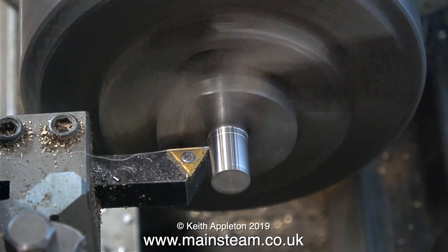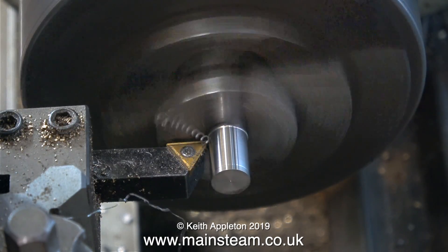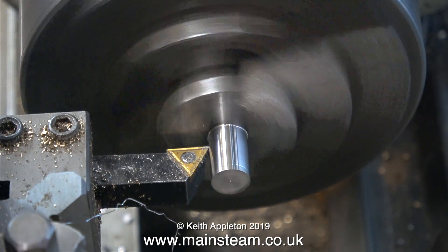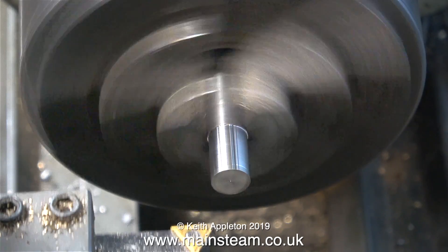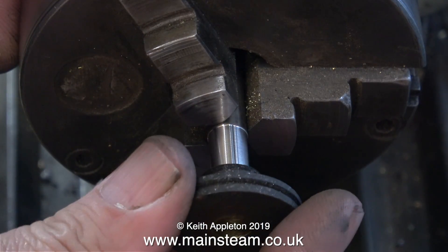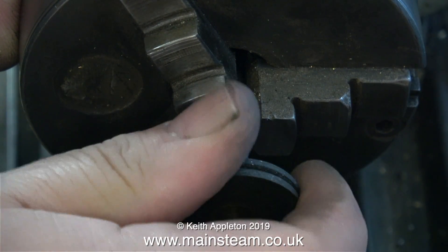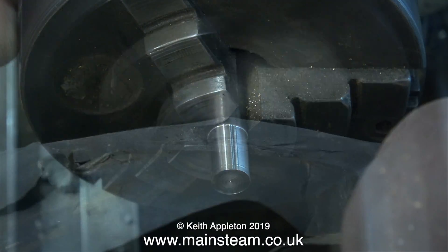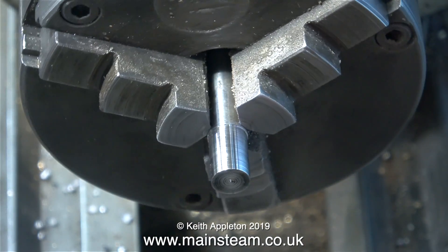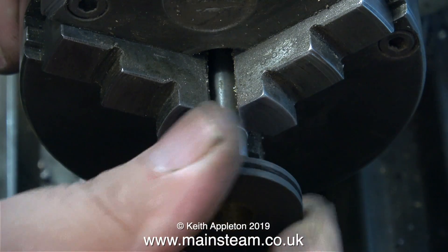It's all a matter of degrees, because sometimes if you do too much repetition it will drive you insane. Anyway — this is the fit that I need: it's a tight fit. I couldn't push this on by hand, so how am I going to do it? First of all I'm going to clean it up with a piece of wet-or-dry sandpaper to make it very smooth, and then I'm going to tap it on with a soft mallet.